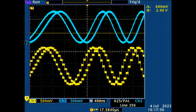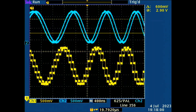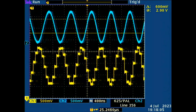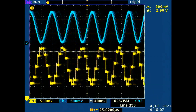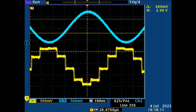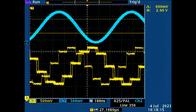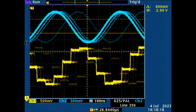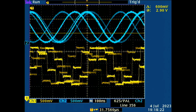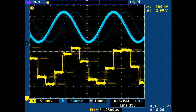The signal that we're generating here is called a luminance sweep — essentially it is a sinusoid of gradually increasing frequency. As we scroll across the higher frequencies and stretch it out a little bit, we can see that the signal before the filter looks less and less like a sinusoid. But no matter how unrecognizable it gets we always have a perfect sinusoid at the output. Without going into all the details, this is just what low-pass filters do — on average the signal is a sinusoid and this filter is what realizes the average.